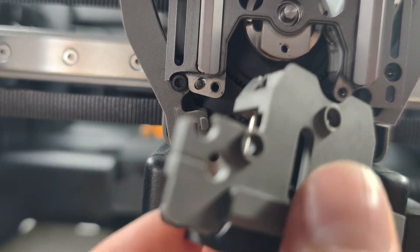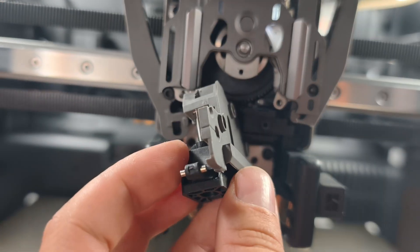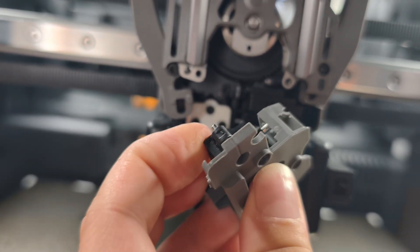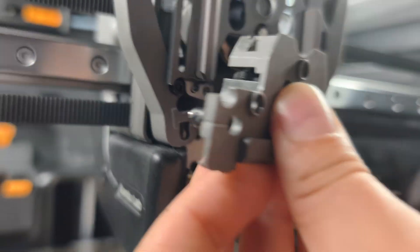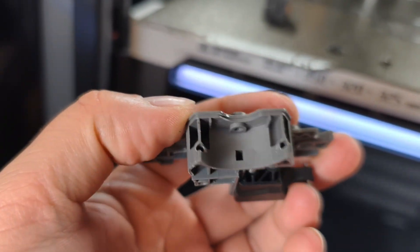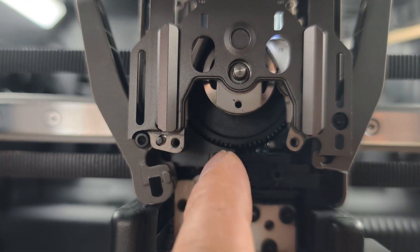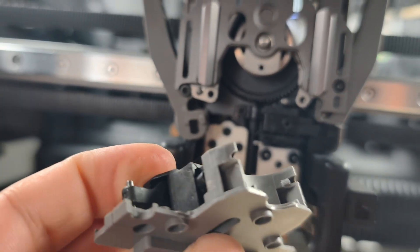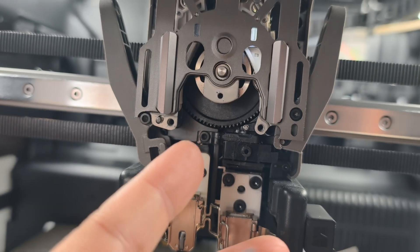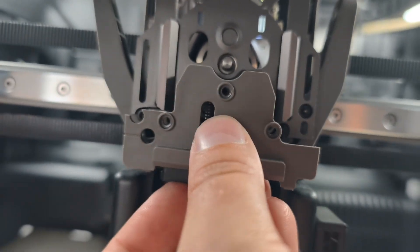The filament cutter is this bit here, and it drops into this groove that needs to come out through the gap. It's a little bit hard to explain, but basically in reverse when you put it back on, you push it all the way up and back up, and then the cutter fits into that groove. You take this off and declog — which is relatively simple — except the filament will be up here, and the drive gear in the middle directly engages those, so when you try and pull this out you're fighting both the cutter mechanism and two bits of jammed filament.